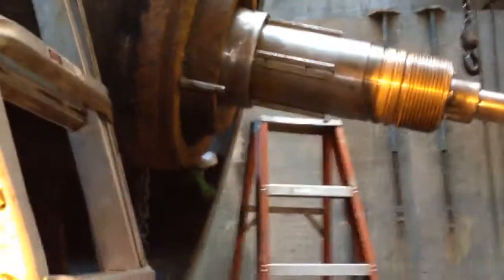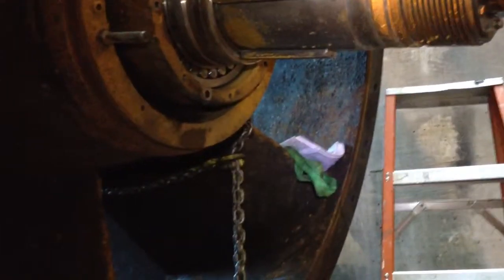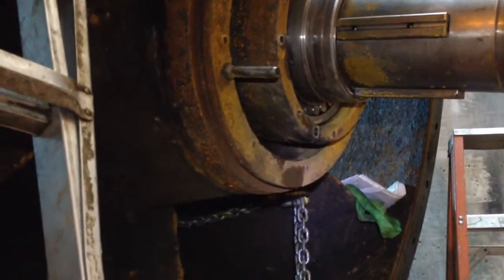We're still trying to get stuff cleaned up here at the mill. The main thing to do is get us back to being able to drain the muck away. One heck of a sludge coming out of this thing. I've tried putting some suction cleaner in there — that's loosened it up some, but it doesn't get the heavies out. I think the big problem is that it's pointed downhill; everything's settling down into this front lip and can't get out of there. So hopefully we'll get it augered out and be able to pass the water, and the seal won't blow out so quick.